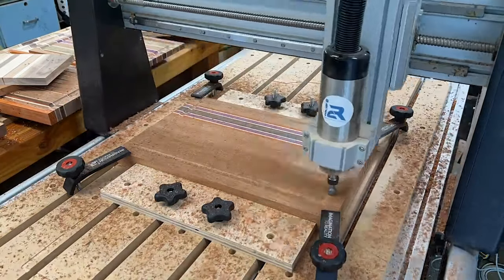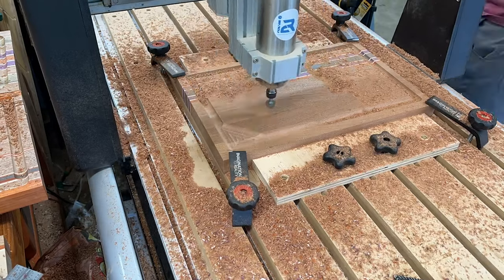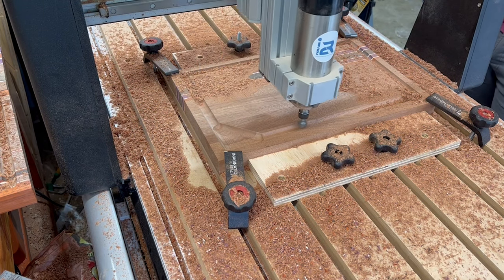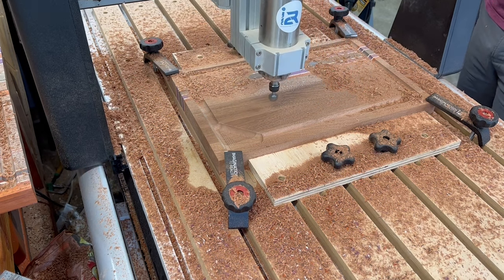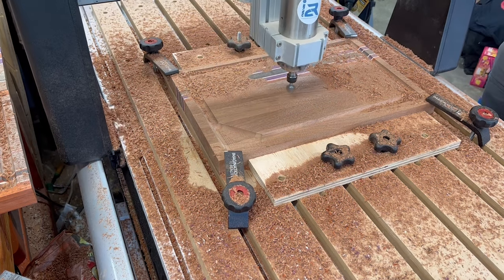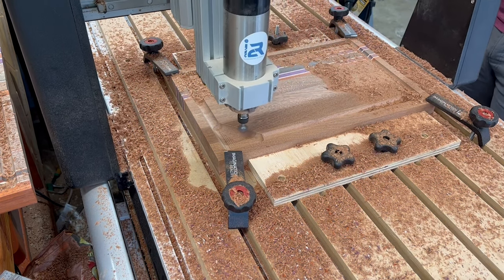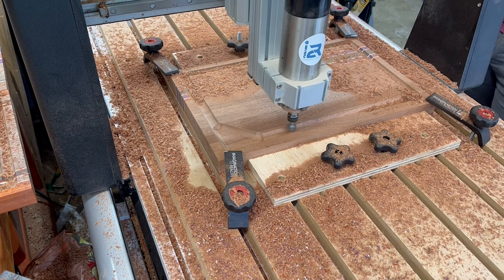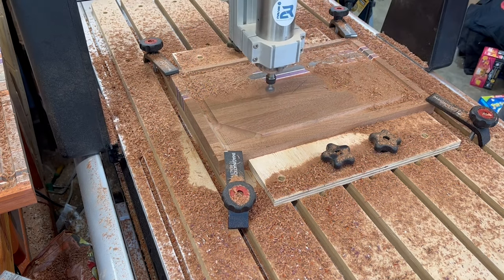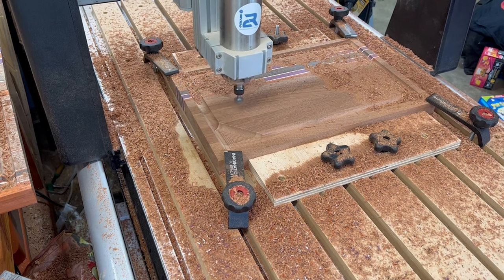Back to the well — adding a triangle. Start with your standard rectangle, then add a well at the bottom (doesn't have to be a triangle). Using a ball nose bit, I started messing around with fluting, which tapers it down and angles the groove lower. I ended up making the well nearly half an inch deep instead of a quarter inch, but with a gradual slope instead of a sharp drop. I recommend testing on a scrap piece first.